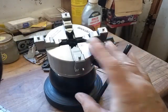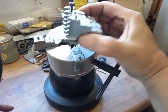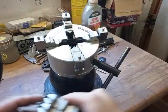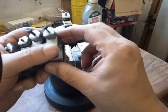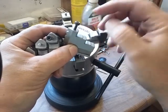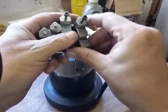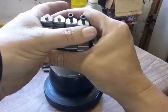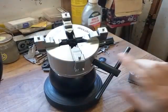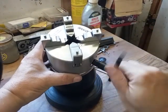And the beauty of the self-centering chuck, you also get another set of jaws for holding right up to the centre. And I'm going to adapt it to take, there's another row of holes drilled there and 5mm Allen keys. I'm going to thread those in the bottom, and I'm going to make other attachments for doing rings, etc, etc, which is the next stage. So there's the setup.